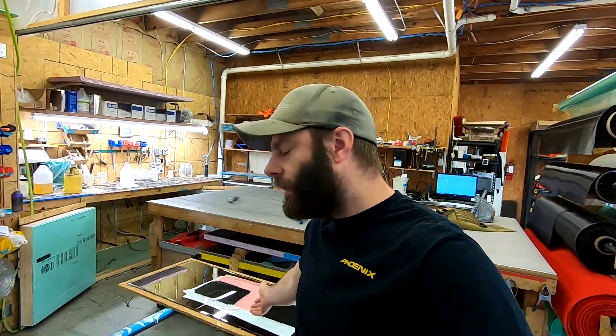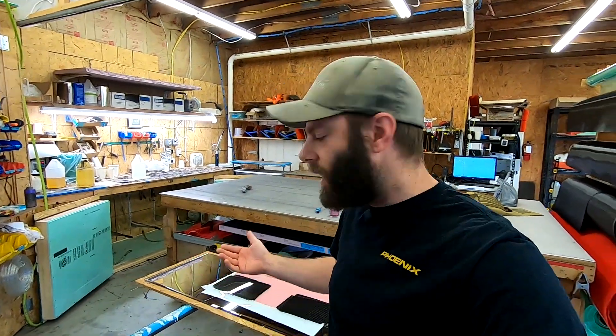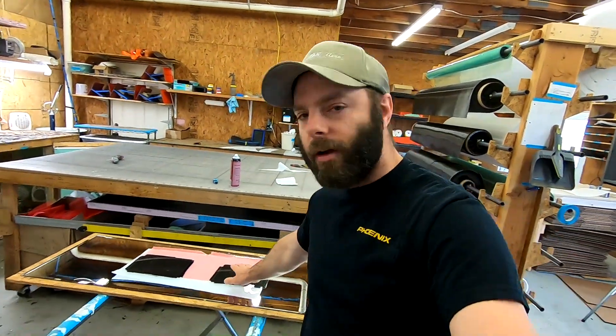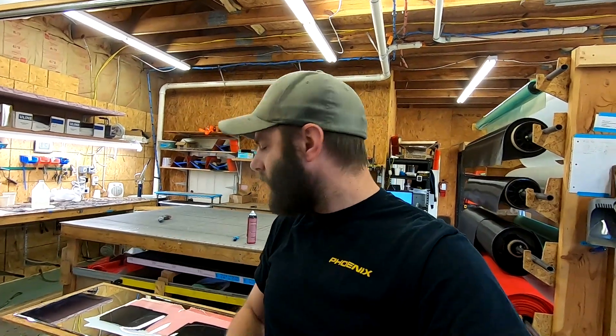All right guys, so there you have it — the way I generally do my part lines in the visual layer of carbon fiber. Like I mentioned earlier, stuff called web lock is nice, a little bit expensive, especially to use for an entire full sheet if you only need one seam or something like that. I have heard of people using other techniques — just spray tack might be enough to hold the fibers together, but then you're working with sticky carbon which could then just fray. Or for a V-weave, you can just buy carbon woven into a V perfectly down the center as well. So like anything in composites, there's a couple ways to do it. Hope you learned something from this one. Hit that subscribe button and I'll see you guys in the next one.